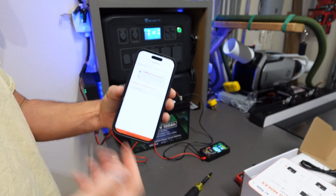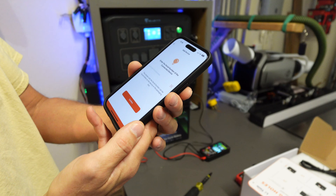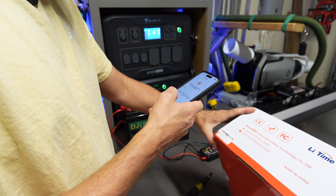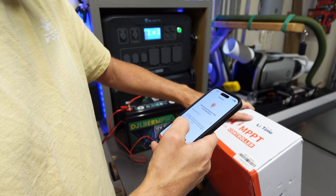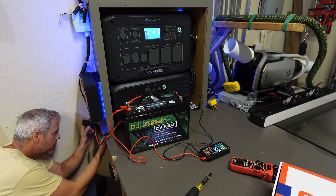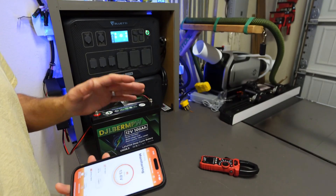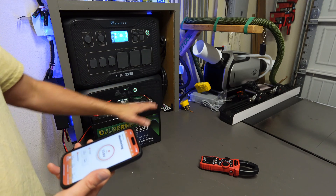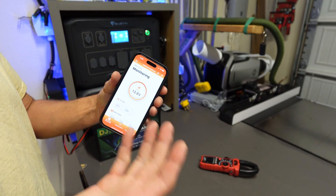I've got the Leadtime app up and scanned for the Bluetooth device. I kept getting 'invalid serial number' errors. After troubleshooting, I discovered I was in the wrong app — you have to be in the Leadtime Solar app specifically. Then I had to disconnect and reconnect the battery to the charge controller to reset everything. After that the charge controller finally showed up in the Bluetooth list and I was able to connect.